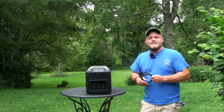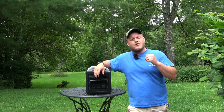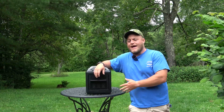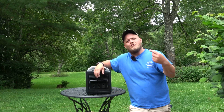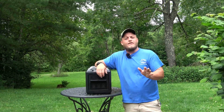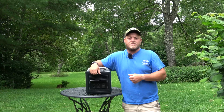In all of my testing, that 10 millisecond transfer switch works very well. My desktop computer does not even turn off when the power supply is interrupted — it's that fast. Same with the Wi-Fi router, though it'll depend on your sensitive device whether it reboots or not. This system transfers power very, very quickly. Including an 1,100 watt UPS is an amazing feature to come on a discount power station.